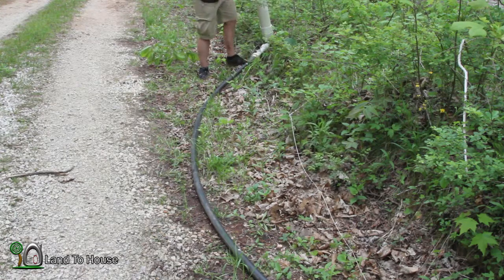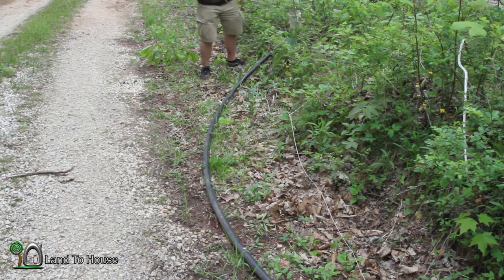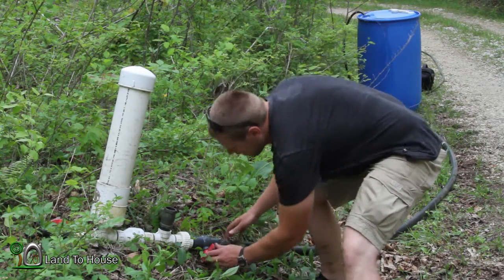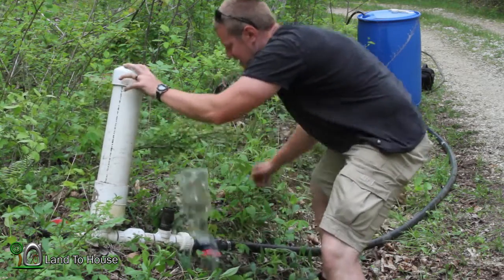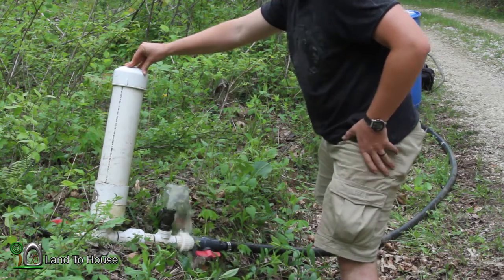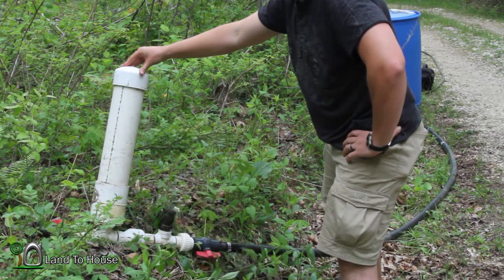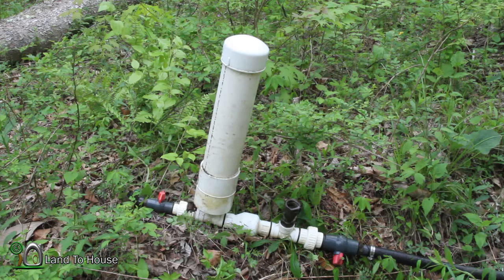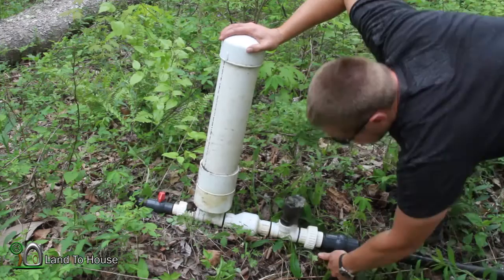If I can get this on this little hill, we'll be right on. I'm going to turn on the drive pipe here and see what we get. I'm going to take that as a yes — it is possible to run a hydraulic ram pump from hydrostatic pressure. This thing definitely has a nice firm bit of pressure too. It's quick and pretty hard.